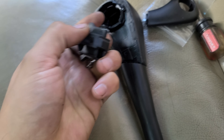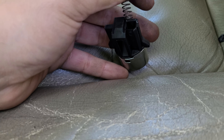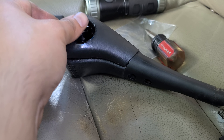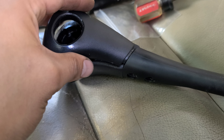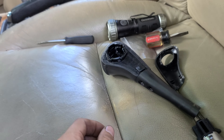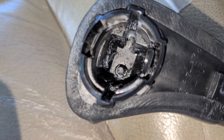Be careful, don't lose the spring — the spring goes right here, you need two hands for this. Now you're gonna pop this little cover off. Use a flat screwdriver all the way around, then pop it from the top. Don't pop it from the bottom. Pop it from the top and pry it — it's gonna come out. Put this piece in there and the spring goes in there.